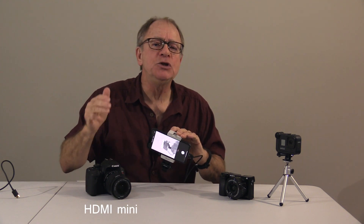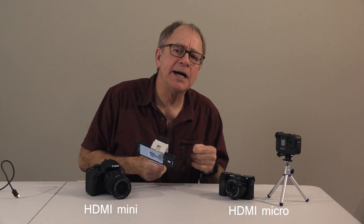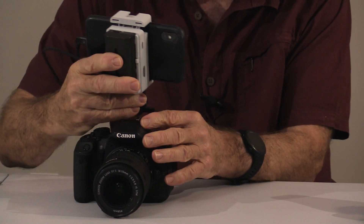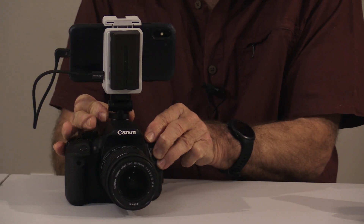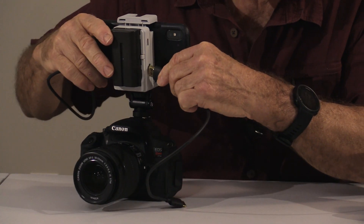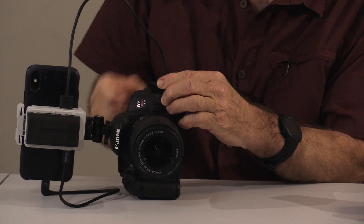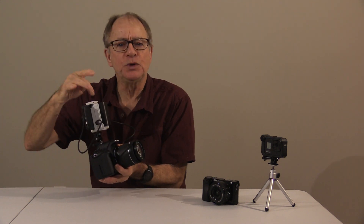For instance, this Canon DSLR uses an HDMI mini cable, while this mirrorless camera and action camera use HDMI micro — so make sure you have the right cable. Let's attach it to this DSLR: mount it on the hot shoe on top, spin the little lever until it locks into place, then plug the full-size HDMI into the CMO and the mini connector into the camera port. Now we just power on the CMO — there's a little button on the side — push it once and the green LED comes on.